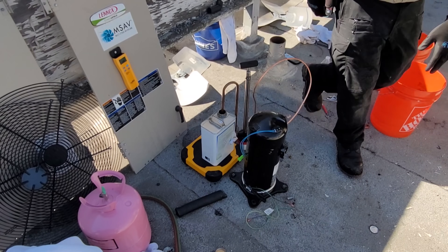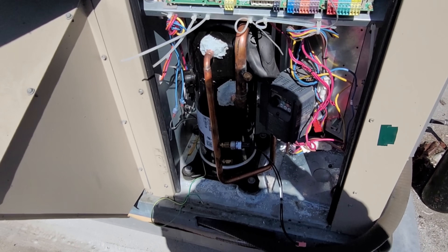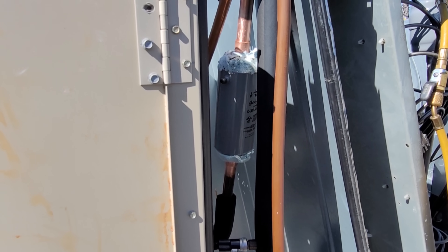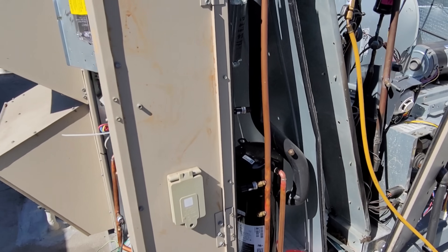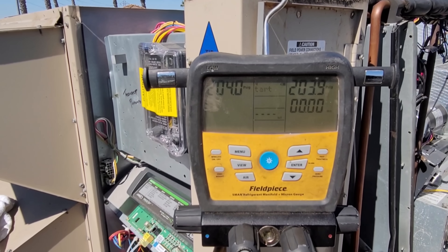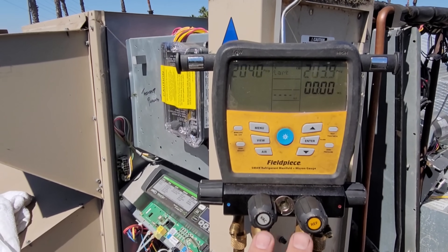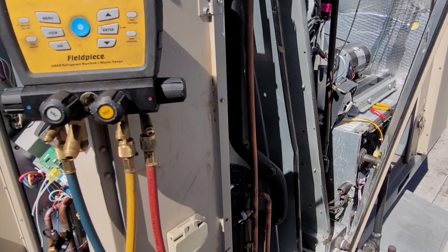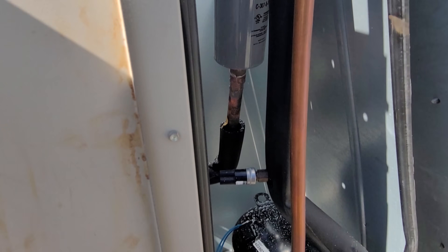That's it — that's all the oil we're going to put in it for now. We're going to clean it up and put it back in. The compressor's back and we're ready to braze it in. Everything's sanded and cleaned up. Same thing with the suction dryer — I was able to get it in there; it's going to be tight and a pain to braze in, but we'll get it. We've still had nitrogen purging through this the whole time.